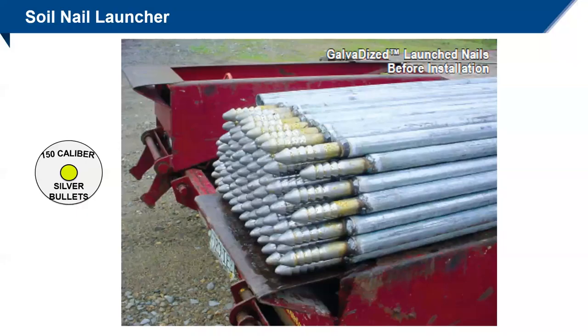You can see it's got a barbed tip and an inch-and-three-quarter hollow galvanized tube. At that barbed tip, we put a collet on there — it's like your air nailer that you'd use for wood construction. We just put a pneumatic compressor on it, jack up the pressure, and shoot it in the ground. But the collet at the tip actually pulls the bar in tension, whereas your air nailer pushes your nail into the wood in compression. Since the bar's in tension, we don't have to worry about it buckling.